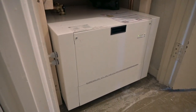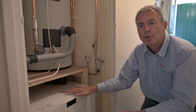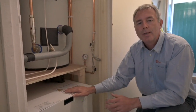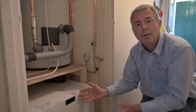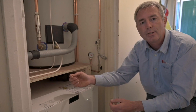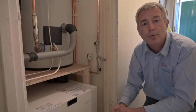We've come inside the property now. This is the ground source heat pump — it's a shoebox model, a six kilowatt shoebox model — and what that means is it gives out six kilowatts of heat. The really cool thing about ground source is that it only consumes two kilowatts or less of electricity. So essentially six kilowatts being given into the radiators and two kilowatts that you're paying for — the other four are coming free from the ground.